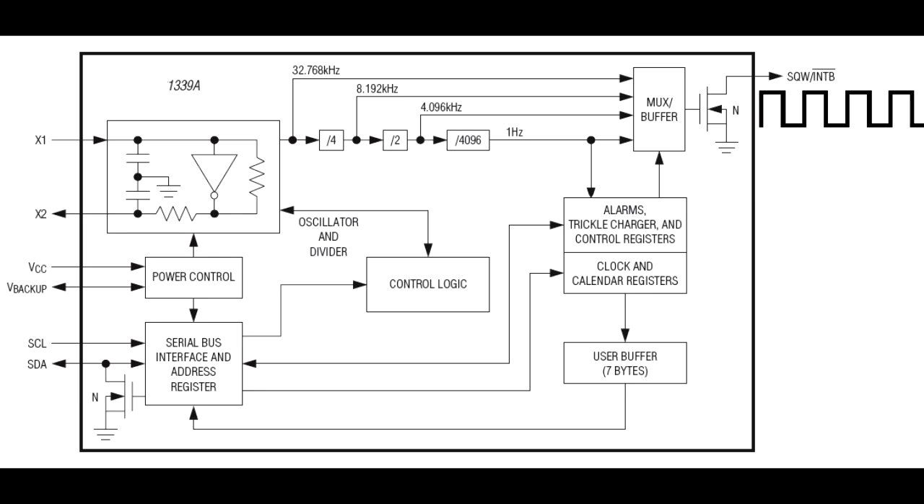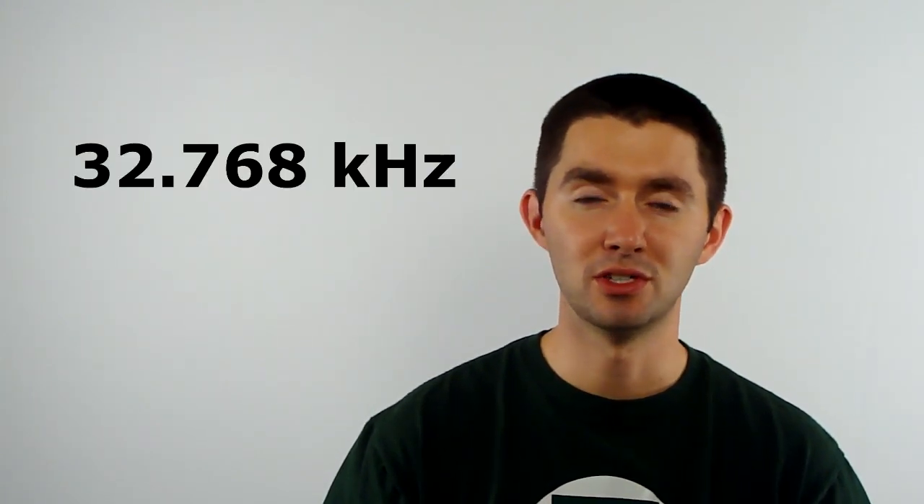There's an output on this which is a square wave, and that acts as a heartbeat that can go back to your micro. You'll need an external crystal — the standard value of 32.768 kHz, because that's a really easy division number. How much you pay for that crystal, and how accurate it is, will determine your overall accuracy; the chip itself should not contribute any significant amount to the error numbers. So it really becomes a trade-off of crystal price versus accuracy. The chip will run you about a buck fifty in 3k quantities.